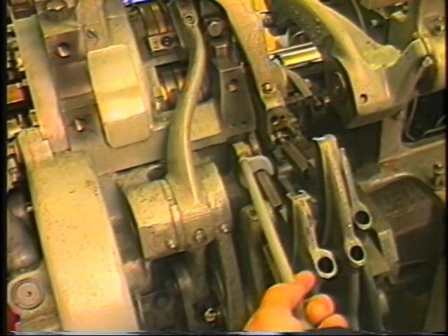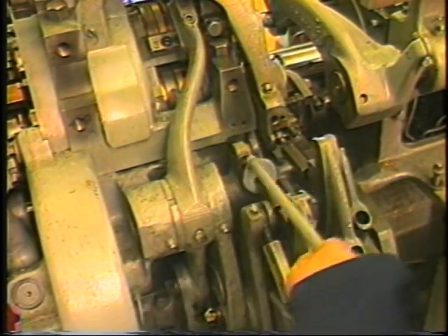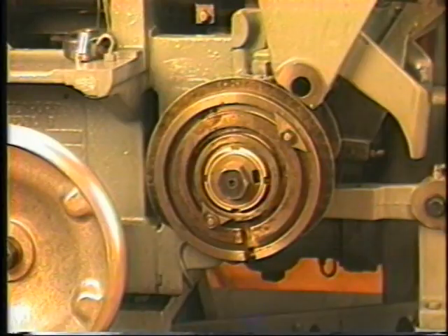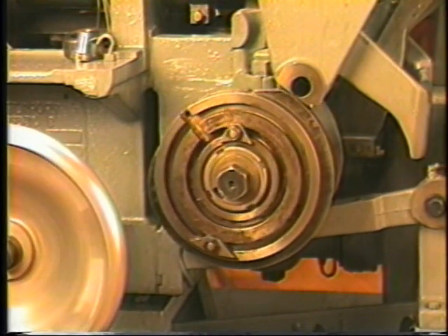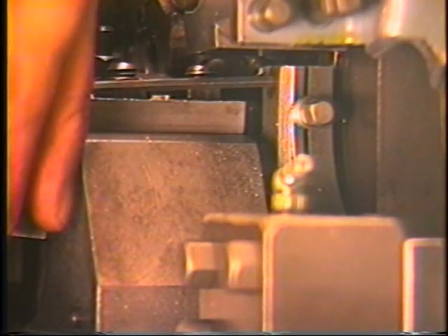We should then make the appropriate turnbuckle adjustments and run a workpiece. When the blank is 10 thousandths of an inch below the finish diameter, it is time to set the positive stop. Advance the machine to the highest point of the form cam and turn the position stop screw until it contacts the stop screw in the revolving head. Adjust the stop screw until the workpiece diameter is correct.